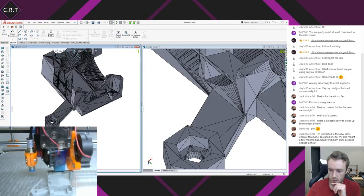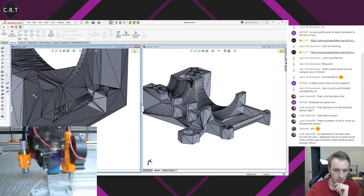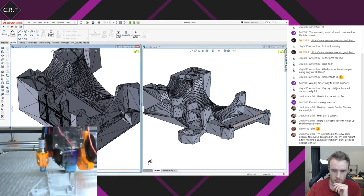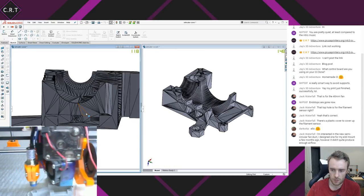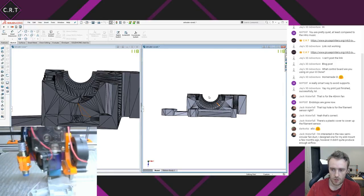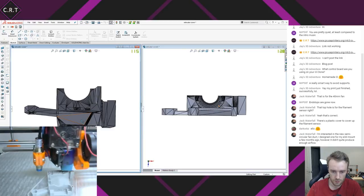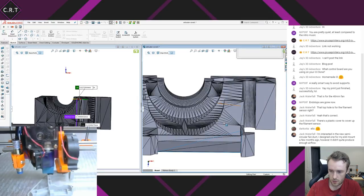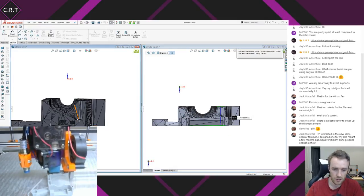In terms of the air ducts, this is where the air duct comes through. Very different there, so we'll take a look at that in a moment and see what that sort of geometry is like. This is very different. So the whole thing stands off. The distance from the center of the extruder to the face where the fan mounts is very different. Let's have a measure. That's 23 mil versus what used to be about 14.8, so about 15, so they've added about 8 mil in thickness.